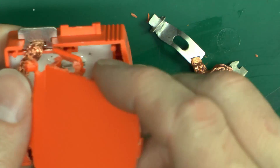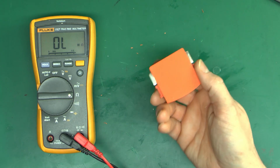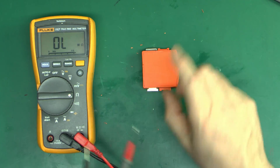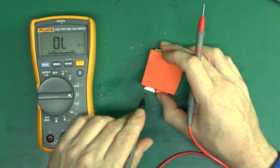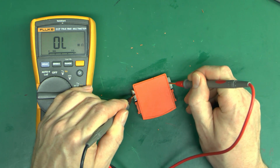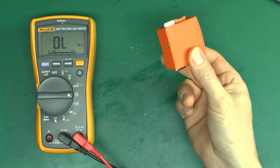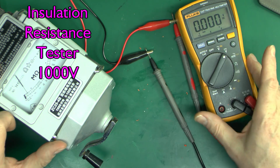In case you're wondering what sort of resistance these things have in their default state, or when normal voltage is applied, it's pretty much infinite resistance - as if they're not even there. This is another module we haven't ripped apart. With the meter, we're measuring 0.1 ohms - just the resistance of the wires. If we measure across the cartridge itself and place those on either side, it's basically showing open circuit. It makes no difference whether it's there or not, which is pretty much what you'd expect.